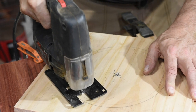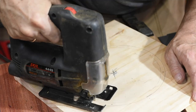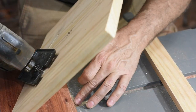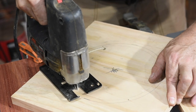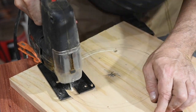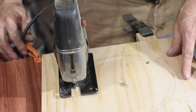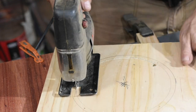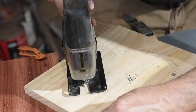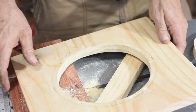The original GA5 cab was made of pine. Some people believe that wood has a huge effect on the sonics of speaker cabinets, and I have no reason to think they're wrong. So I decided to make the baffle from pine — actually, I just didn't think spending a bunch of money on exotic wood that was going to be painted black and covered with plastic grill material made any sense. If there's an acoustic benefit, and there may well be, I'll take credit for that too.